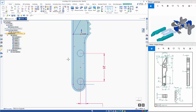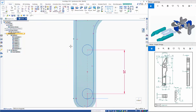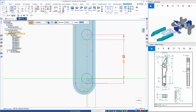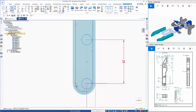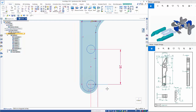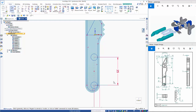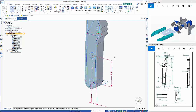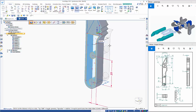And then I'll use a connect relationship. What I might do is get that closer. So if I drag that down to somewhere close, then I can use my horizontal vertical relationship, center point to the point there, and close the sketch. The first bit is a millimeter in, so if I pick up on this region here and go on the arrow, that needs to be 1 mil.